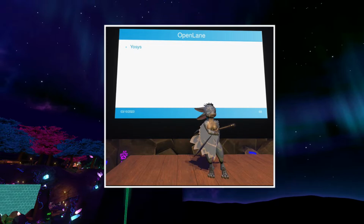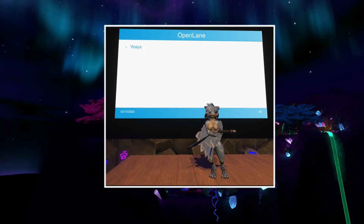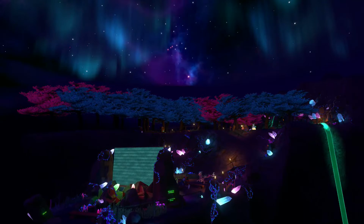You have to think of it like when you go to actually draw up a schematic of a circuit you want to build physically, you kind of open up your notebook or open up KiCad and start drawing up the schematic diagram, but it's very abstract. Right? The schematic diagram only shows what is supposed to be connected to what. You're not actually giving any details about how this should physically look. That's what Yosys does.